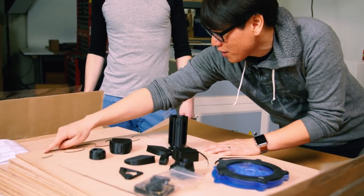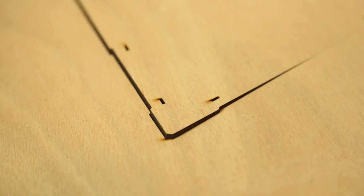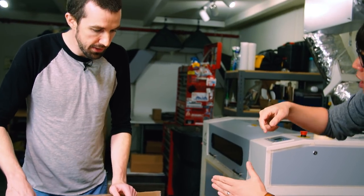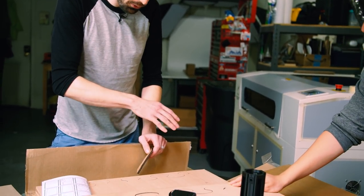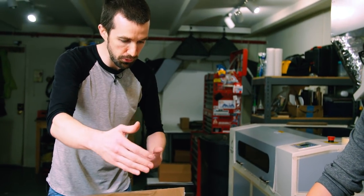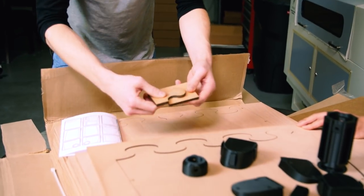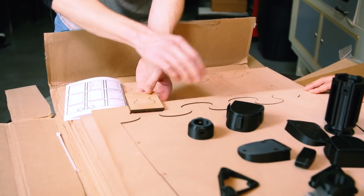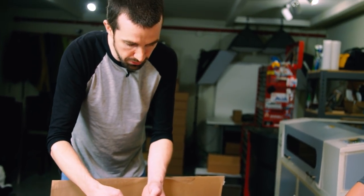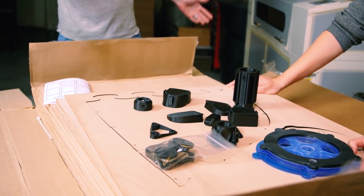Even here you can see this is like a puzzle — literally. The pieces connect, and these holes are where you have your zip ties. This hole would connect a piece at a right angle, you'd zip tie it, pull it taut, and put epoxy on it. Because of the laser's size limits and ease of shipping, you need six-and-a-half-foot lengths for the six-foot boat, achieved using this puzzle joint technique. When enough puzzle joints line up, you don't even need clamps — just run epoxy along the lip, stomp on it, leave it to cure, and it's as good as a large sheet of plywood.